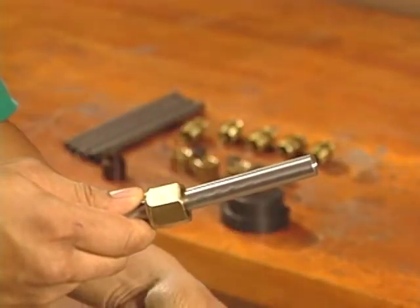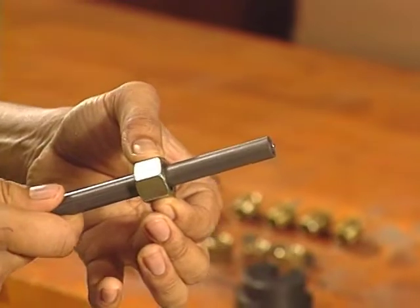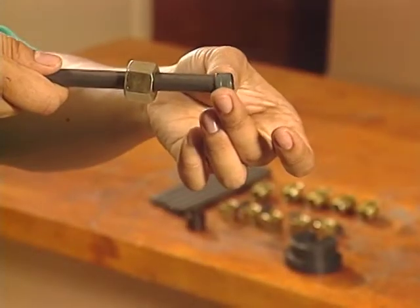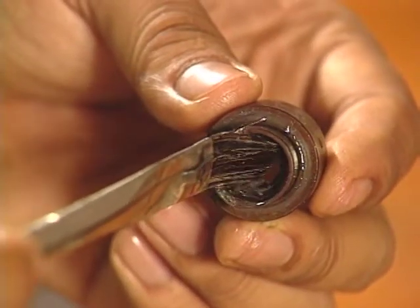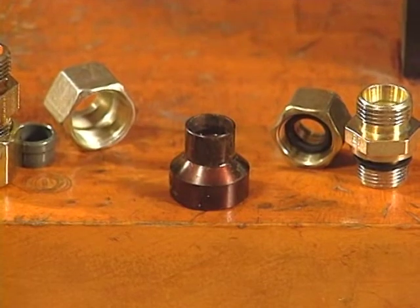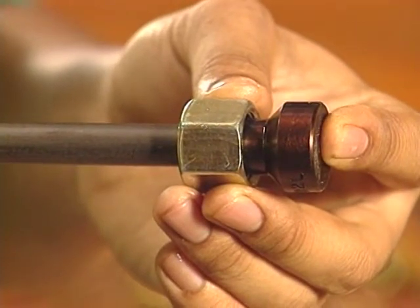Next, install the fitting nut and ferrule onto the tube. For EO2 fittings, the functional nut assembly is installed on the tube with the assembly's threaded end facing the tube end. For EO fittings, the nut goes onto the tube with the threaded end facing the tube end. The ferrule's straight pilot section, or bite edge, faces the tube end. For EO fittings, also lubricate the outside surface of the ferrule with a high-pressure lubricant like STP, and lubricate the inside surface of the body die. For both EO and EO2 fittings, install the body die by placing it over the tube end until the tube bottoms out in the die. Push the nut and ferrule, or the functional nut, toward the body die until the die enters the nut bore.